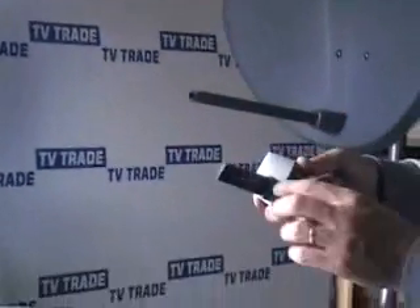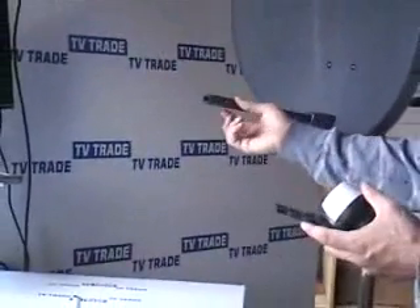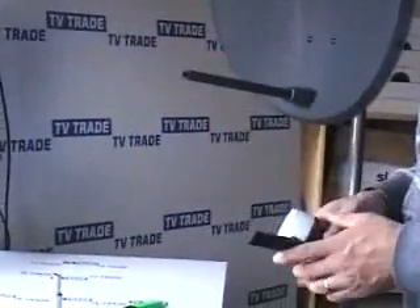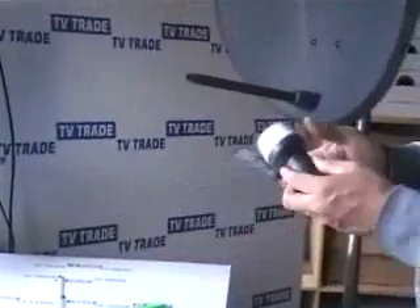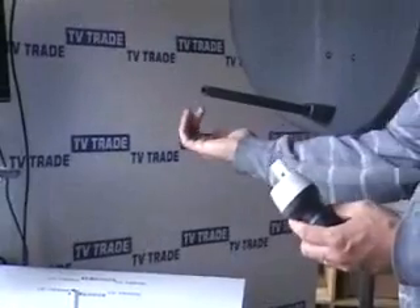The insert on the base of this LNB is not exactly the same size as the metal tube, so between the tubular arm and the LNB we have a plastic insert. Sometimes the insert will come out with the LNB when you pull it out, and if it does, it should be reinserted before putting in the new quad LNB.